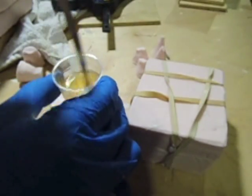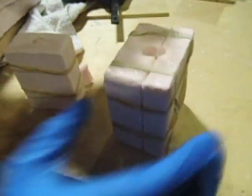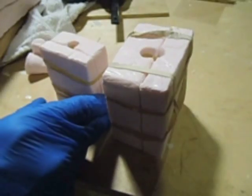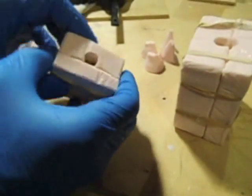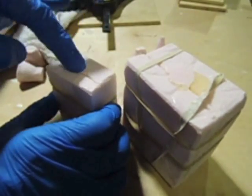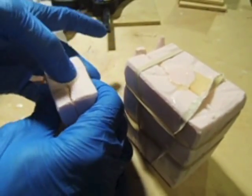I have to work quickly before the resin sets. I band the mold halves together with rubber bands and mix a slightly larger batch of resin and pour it in to fill the rest of the jaw and the head. I'll tap it on the tabletop to release the air bubbles, and then press the cork into the mold to seal it shut.